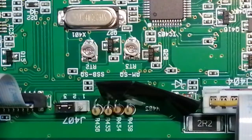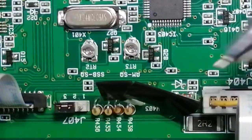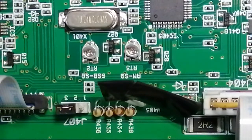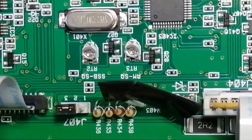I've skipped the boredom of watching my big fingers trying to remove the plug on J407. I've moved it anyway using a fine pair of pliers from position one and two to two and three. The white wire I've also insulated now with some tape around it — so it's nicely protected and it's not going to short out on anything. That is the modification. Now basically to reassemble it and we'll see if we've got any increase in power.